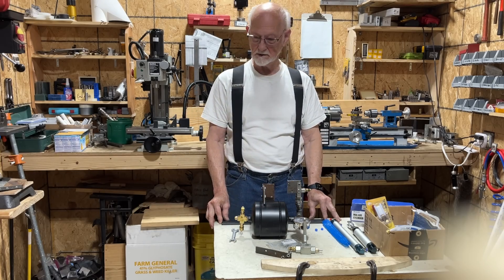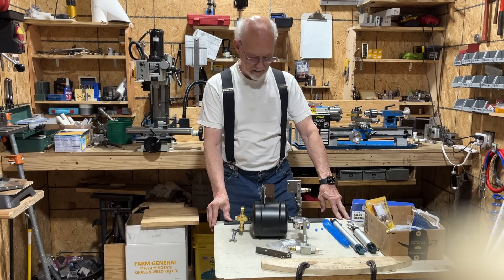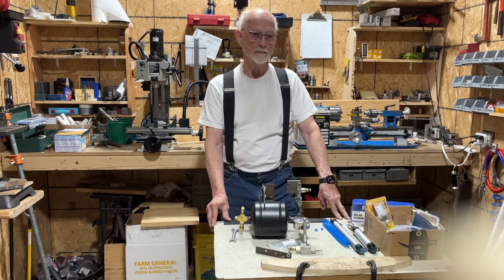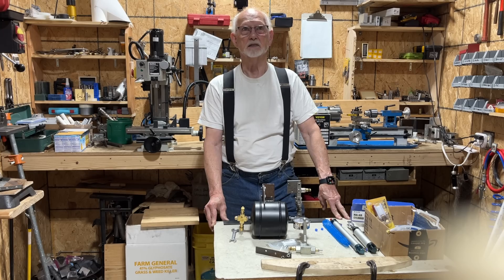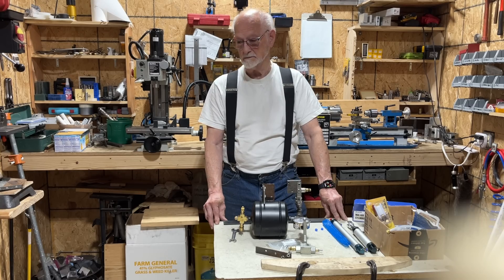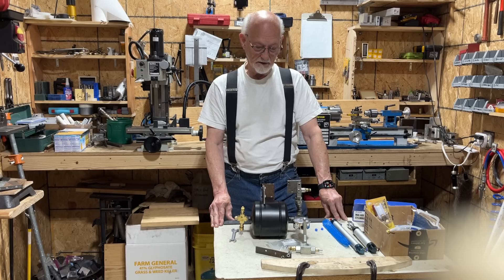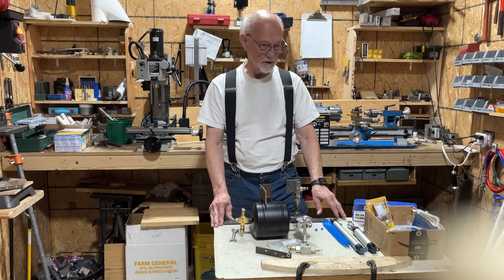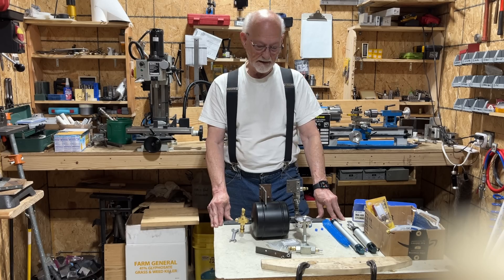You saw that it runs. It didn't quite go as fast as I thought I would like. I'm thinking maybe I need to have a little bigger pistons in it, and I'm going to have to run a little bit higher pressure. That was around 300 psi on the last run. It has a fair amount of power. I'm still working on the six-cylinder for my Volkswagen, but that's going to be a while. I need to get this pressure flow regulator done — the one I purchased just does not allow enough volume.